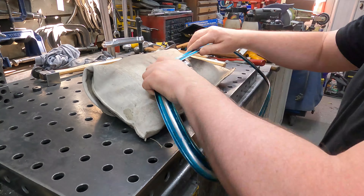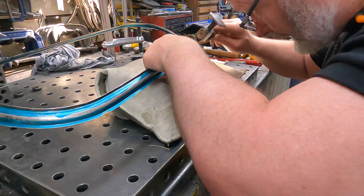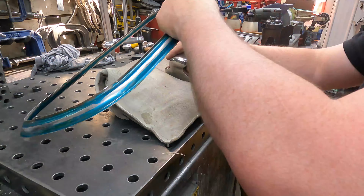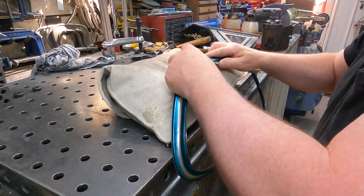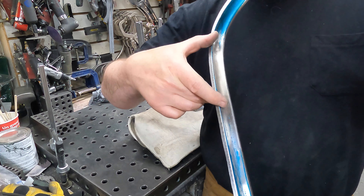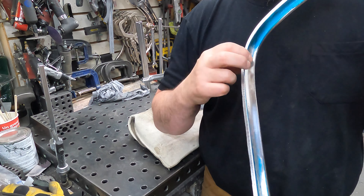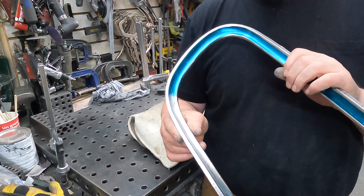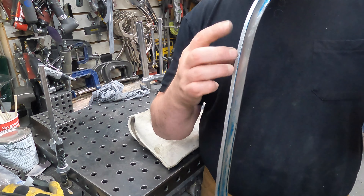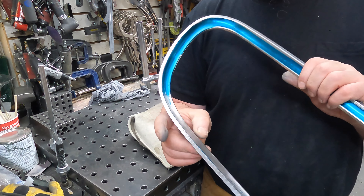You could use a magic marker — it doesn't really much matter. I've started just the sort of careful and terrible process of picking the surface. You go ahead and just work it ever so carefully trying to get this surface as absolutely perfect as possible. This took almost weeks to get done. That's the first 75 millimeters — about three inches — done. That takes a long time to do. I've got to pick the rest of the surface. That was actually one of the worst spots. I usually start at the hard stuff first because then the rest of it's easy. There's still lots of surface correction to do.